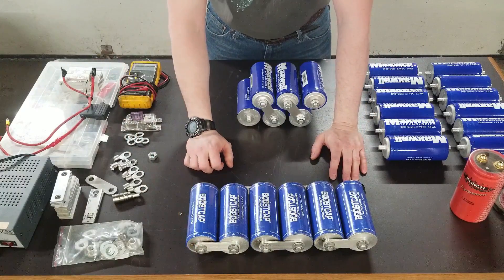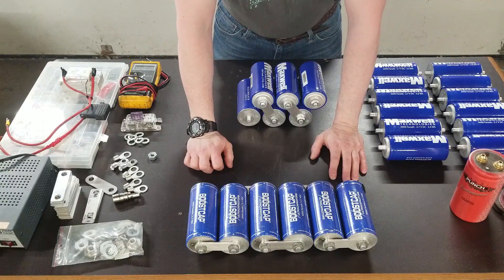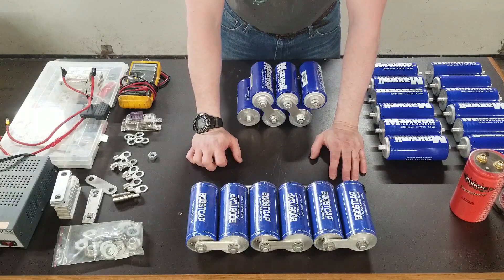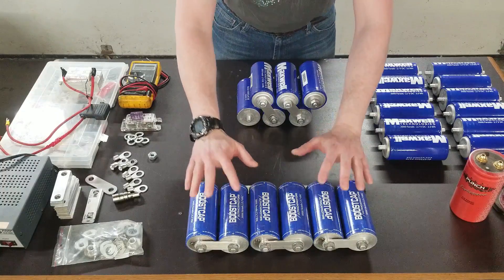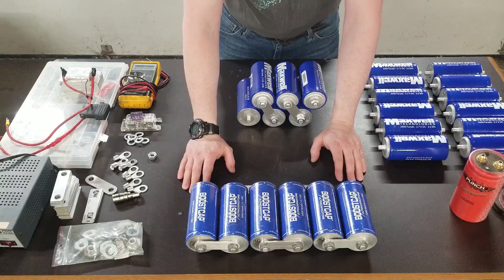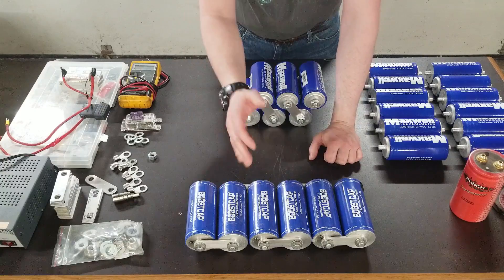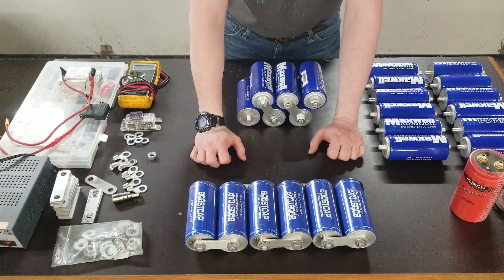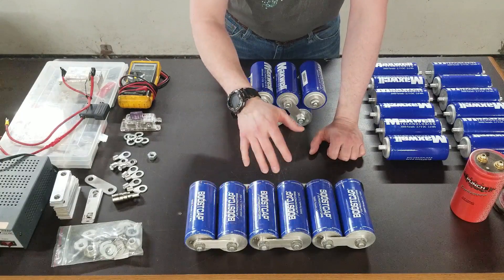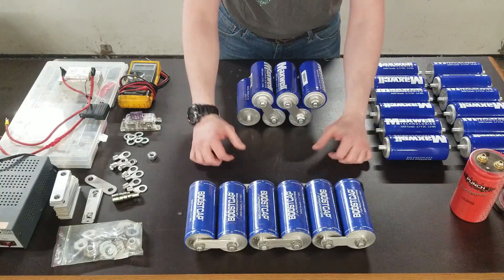The short circuit current of a fully charged capacitor is upwards of 9,000 amps. The useful high current on a regular basis, as part of the one million duty cycle, is over a thousand amps — a tremendous amount. Normally you would buy these inside a plastic case that looks like a battery; some manufacturers do sell a pre-packaged battery-style arrangement, though you pay a lot more for that.